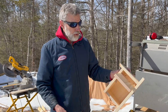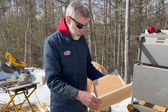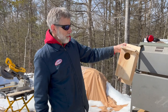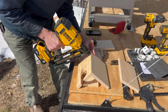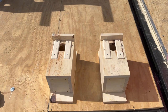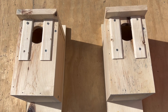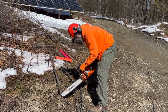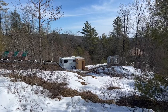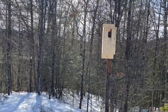Charles shows off his birdhouse prototype, which features a door on the side to clean out the nest box in the fall. A link to the birdhouse plans will be in the description — it was a simple design and he finished two houses before lunchtime. The entry hole turned out too large and round, when it was supposed to be 2¼ inches and not perfectly round, so Charles patched it up to the right size. He then made a couple of posts to hang them, and they still need to add a baffle under each one to keep out squirrels.